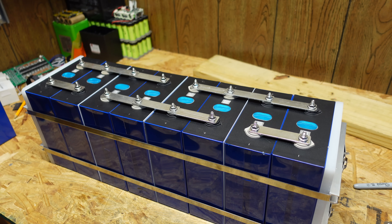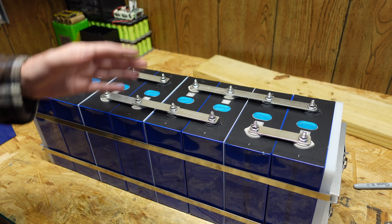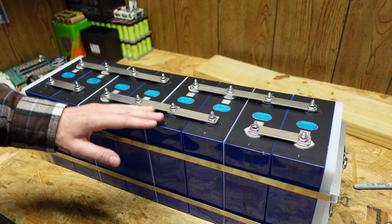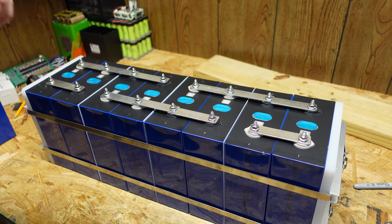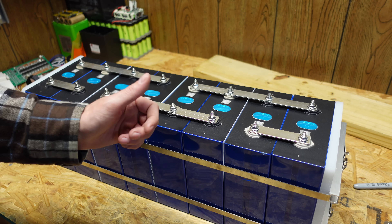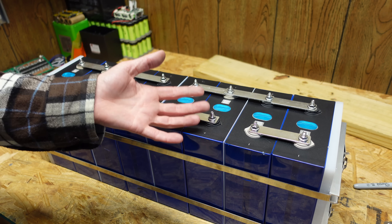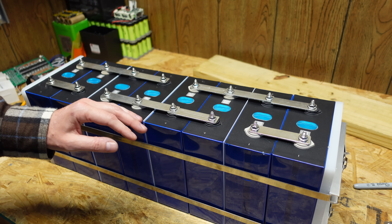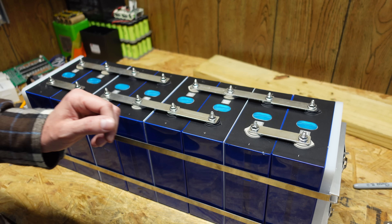Now there is a lot of exposed metal up here, so I'm probably going to keep this covered — I only have it uncovered for the purposes of this video — because I don't want something dropping across here and welding or melting. I also want to thank everybody who provided feedback on my last video regarding Loctite. I decided not to use Loctite based on your input. The original issue I was trying to solve was: number one, the studs felt loose, and number two, avoiding bottoming out in the terminal. The first issue was resolved by tightening with the Allen wrench — I didn't have them tightened well enough the first time. The second issue: I'm only using 35 inch-pounds, and 35 inch-pounds is hardly any torque at all. I don't think there's any concern of damaging the bottoms of these posts when using a torque wrench to ensure you're not exceeding the recommended torque.